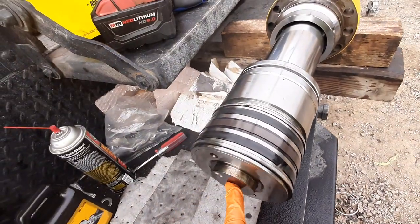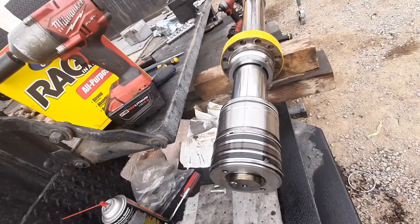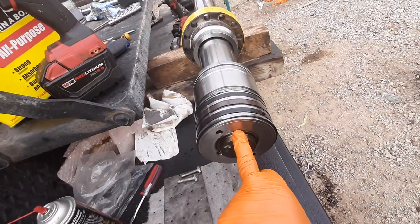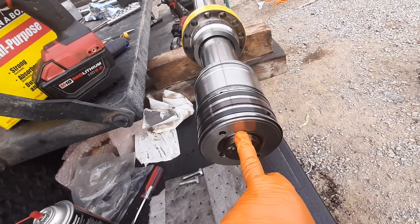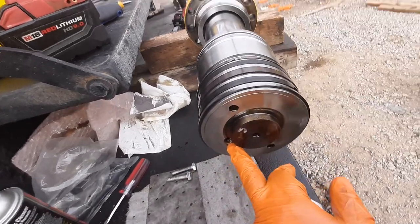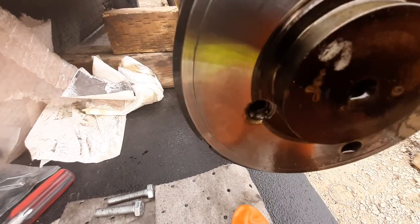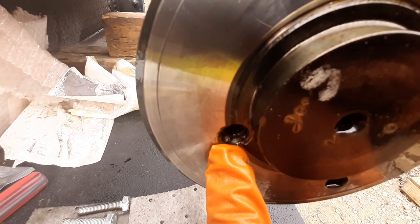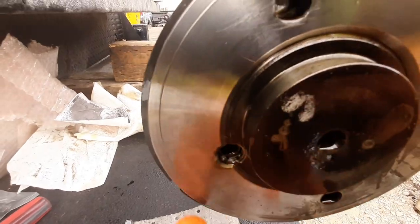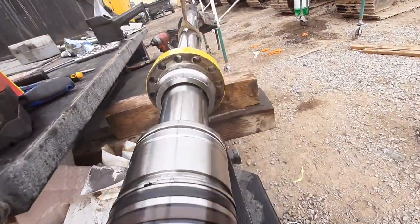Komatsu's are really nice because they don't have any compression or torque on the piston. It's actually a set screw right here, and inside that set screw has been tapped with a prick punch — that's to help keep the set screw from backing out.